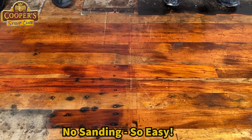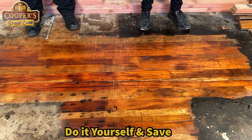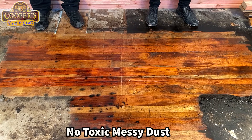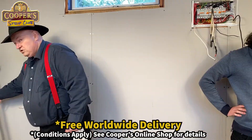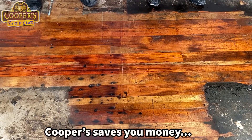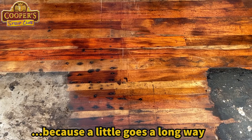And we're done. Beautiful. This shows you what you can do with a really old floor that just looks like it's got no future — and it just was amazing. As we said before, this floor is as hard as nails through time and walking and everything, so it's going to wear really, really well. To maintain it every now and again, if it's looking a little bit lacklustre, you just puff moisturiser onto it. If it's got a bit of grime, grab the blue pole with the grip pad and your stringy mop. Basically, get some tools — when you buy a new carpet, you go out and get a new vacuum cleaner. So get yourself a floor polisher if you've got big floors. Once you get the hang of it, it's an unbelievably easy floor to look after. And the cool news is you never, ever, ever have to sand it again — because you didn't even sand it this time. It's simple maintenance and the floor gets better and better over time.